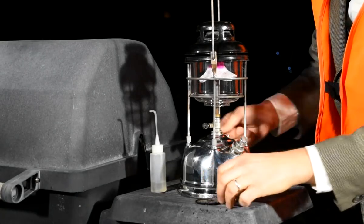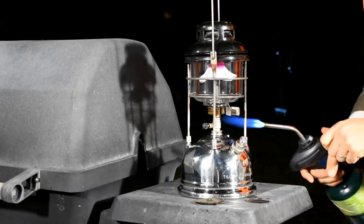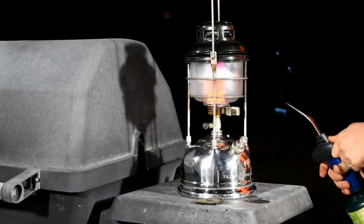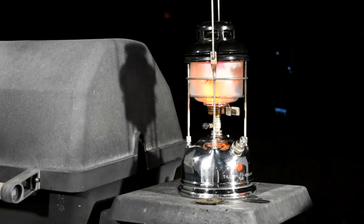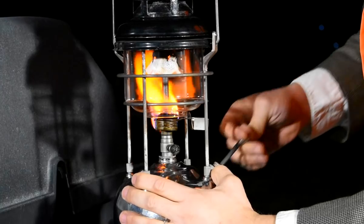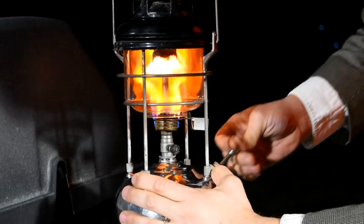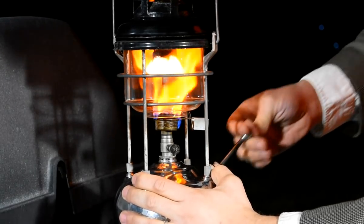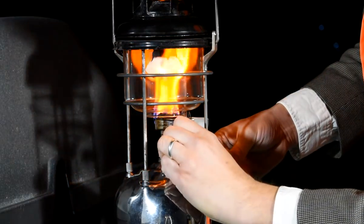Lighting a Tilly lantern is a process I've covered before. The Tilly torch gets soaked in alcohol, then you light the torch and wait. It's pretty cold out, so I'm going to reload the torch and burn it again before I try lighting the lantern. Here I'm doing a soft start — the valve is open and I'll just add pressure until the lantern lights. I like doing a soft start on a newly rebuilt lantern; it ensures there isn't much pressure if something goes wrong.